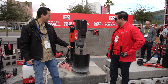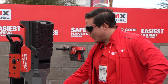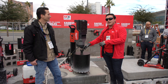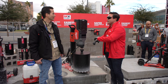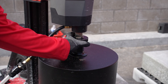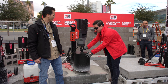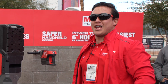Right off the bat, there are some unique features you see with this product. Taking bits off today is a complicated process — you need two pipe wrenches, you've got to wrestle them with each other, finally get the bit off, and then switch out. What we did here with the bit release device is that it's able to absorb all the tension you develop while coring. Then you can twist the collar when you're ready to switch your bit. All that tension is released, and you can unthread by hand, saving you all that time on the site. You don't have to fight with your rig every time you need to change diameters.